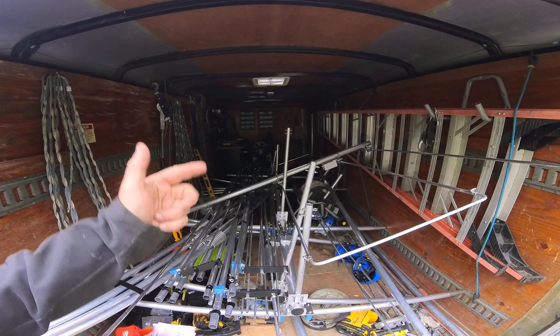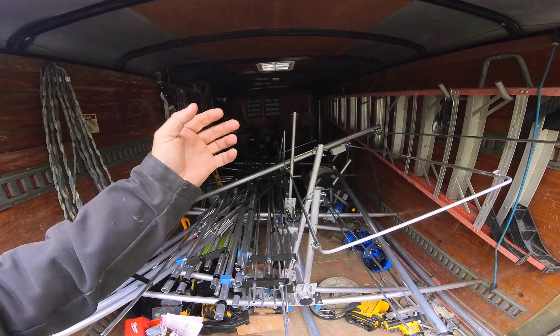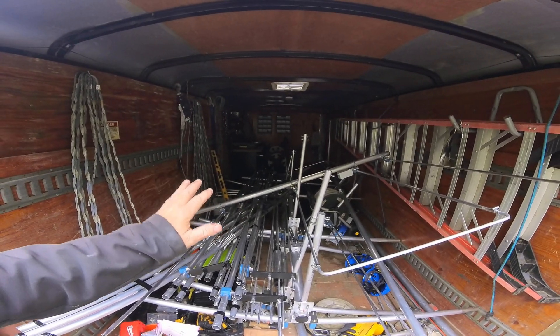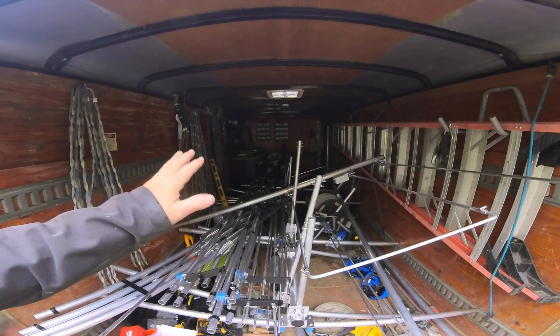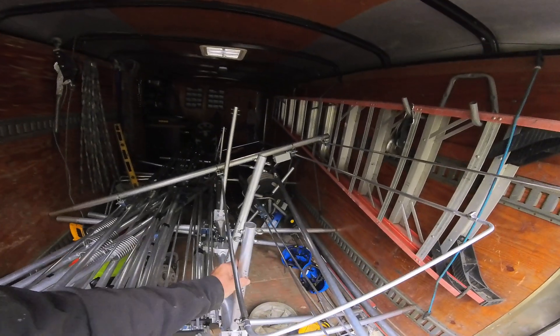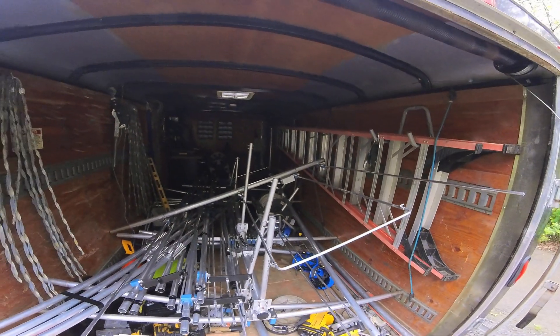You get 10, 12, 15, 17, and 20 meters — that's five bands with three elements each. Then there are two elements on 30 and two elements on 40. I will show you this in another video from the transmitter site, so please follow us into the next video that will be forthcoming. These are the vertical pipes that hold the ropes to the elements — those are for the 20 meters, the underneath elements. And this is the six meter.